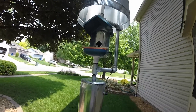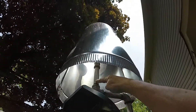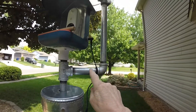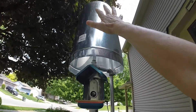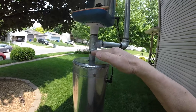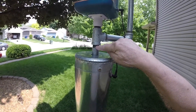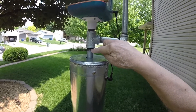Back down here on the ground, I've got my stack of three-quarter inch — elbow, three-quarter, elbow, three-quarter, elbow — into a T. From the T it's just a straight shot. You need your lower three-quarter inch pipe to be a little bit out of the ground beyond five foot, so the five-foot duct just sits on the ground. This three-quarter inch pipe needs to be about eight feet long, so I have a five foot joined with a three foot — five foot above ground and three foot down inside the ground.